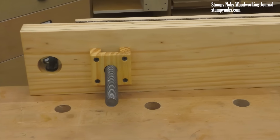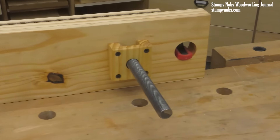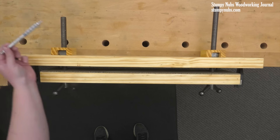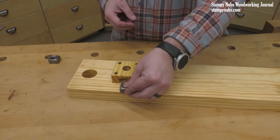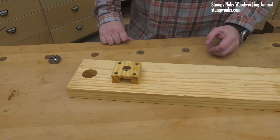There are lots of Moxon vise videos out there, but this one is different — it has a clever design that solves some key problems. Normally, the threaded rods are affixed to the back jaw and they stick out past the front jaw where they just get in the way when the vise is closed. The obvious solution is to attach the handles permanently to the rods and then have the whole thing screw into the back jaw, but it becomes very difficult to align the embedded nuts in that back jaw in a way that allows smooth operation without binding in the threads. This design solves that problem by means of a square nut and a homemade flange that allows everything to self-align when the vise is assembled.